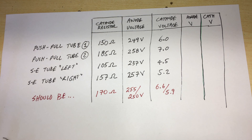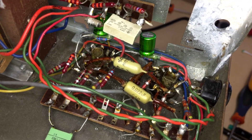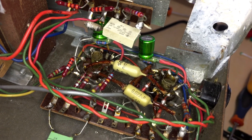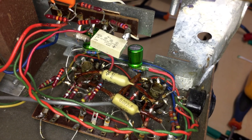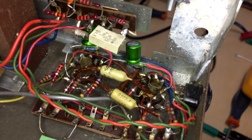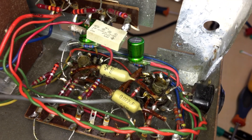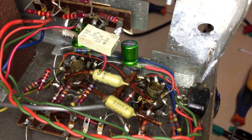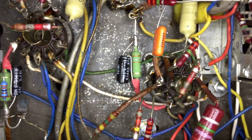It's quite intimidating when you look at that mess — having to go in there and solder a resistor and a capacitor. First you have to remove the old ones and then solder new ones on. The only thing I can tell you is nothing's impossible — just do it very slowly and very carefully. What I've actually done is join the components together before putting them in. Let me show you on the single-ended ones — there you have the example.